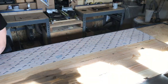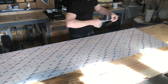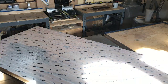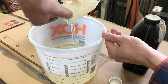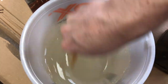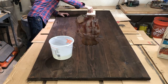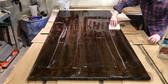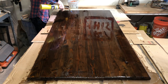Here I am masking off the bottom with some Tyvek tape, preparing the tabletop to get its epoxy coating. Here is the tabletop epoxy — mix it up, and then we will add this in one large flood coat. This is allegedly self-leveling but you've really got to help it along, so just spread it and coat the whole thing and get it as nice and even as you can. I am using a torch to pop surface bubbles.